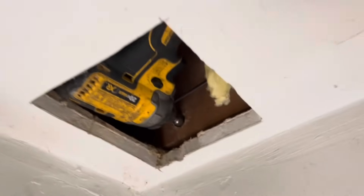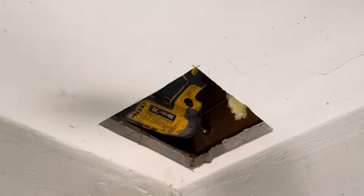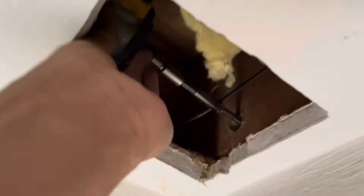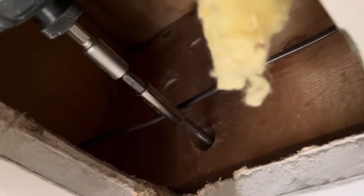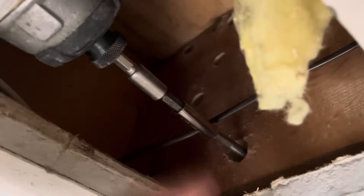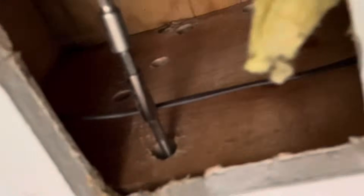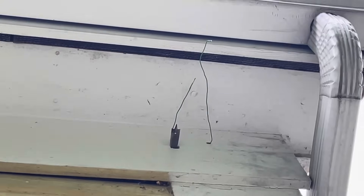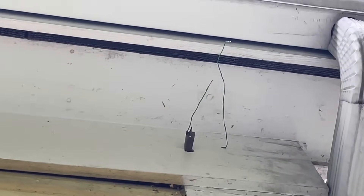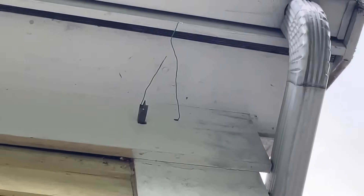So I went ahead and drilled through — this wall has been shockingly thick. I had my spade bit and it went all the way through and I still wasn't through the wall, so I had to add one of these drill extensions, and then another, and then another. Finally after a bunch of extensions I was able to get through. You can see there's lots of dust from the many attempts which I'll have to patch. Over on the other side you can see the spade bit has come through, which is very exciting. There is a smaller hole from where I drilled first not realizing how deep the wall was, and then I just sent the spade bit right through. I ran a little wire to use as a temporary fish tape.